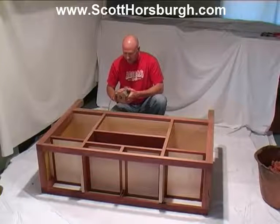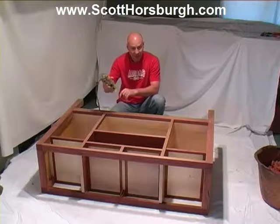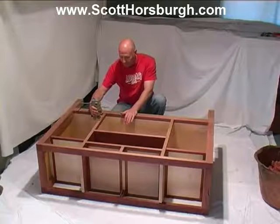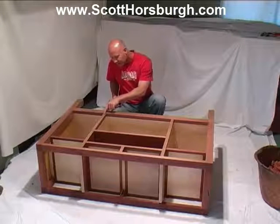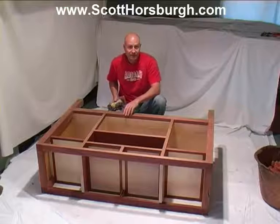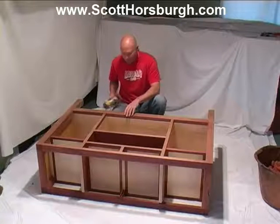And it's really simple. It has a bearing, so I can only go as far as that bearing. And I'm just going to take it down gradually to a depth of 12 mil and run it around. It will leave me with little circular curves at the corner, which I will then just chisel out. So that's what I'm going to do now.